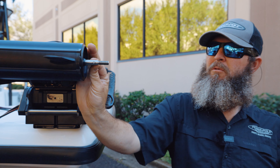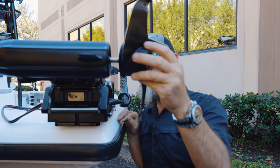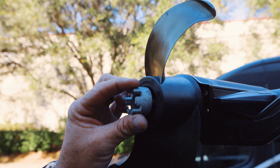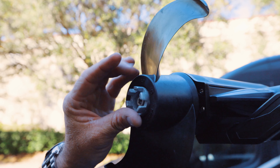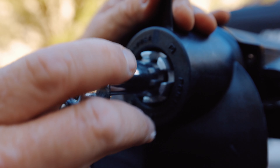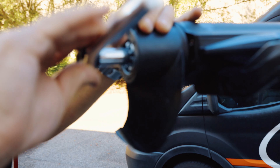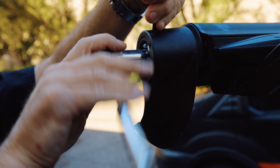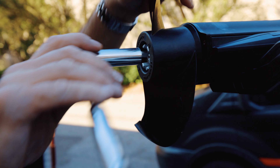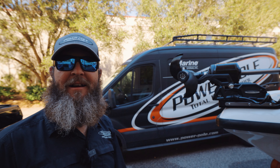We're going to turn the propeller shaft horizontal so the prop shaft does not fall out. We're going to take a deep socket 9/16ths, take our prop anode, and hand-thread it on — making sure we're not cross-threading it. We have a stainless nut on a stainless propeller shaft, so you want to tighten it up with a ratchet, not a drill or an impact. We're all tightened up and now she's ready for the water.